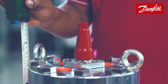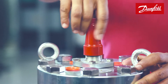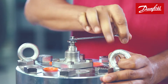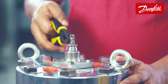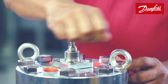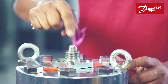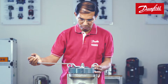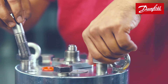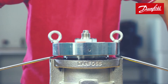Initially, measure the distance between the valve body top and the top edge of the top cover. Remove the cap and turn the manual opening spindle in an anti-clockwise direction upwards to remove the lock ring and lock washer. Now turn the spindle in clockwise direction to push it downwards out of thread.